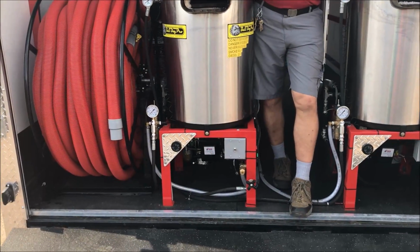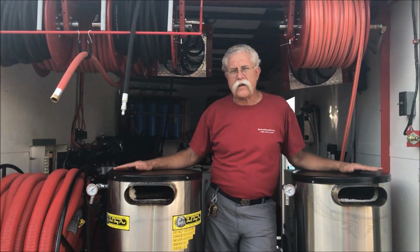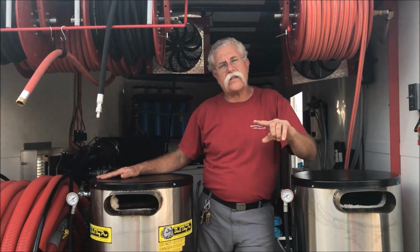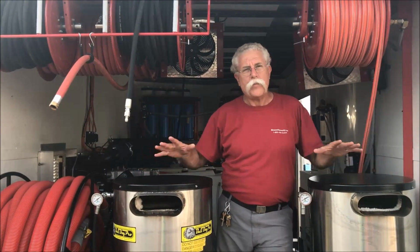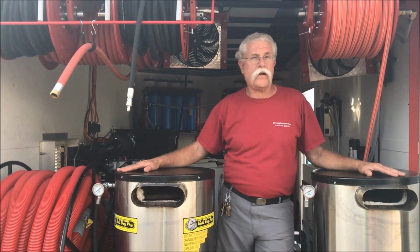We've insulated the walls as much as we can insulate them from the outside, and that's a great starting point not only for insulation for cold weather, but that's a great starting point for keeping a system quiet. The better insulation you have between the floor and the walls, the more quiet you can make a system run.